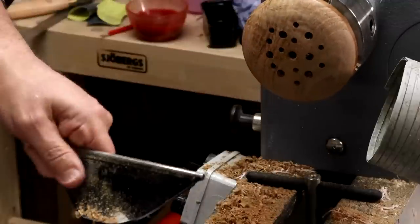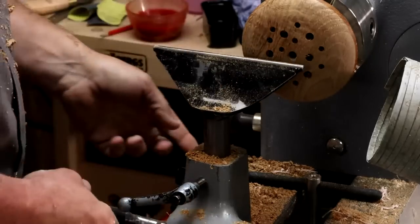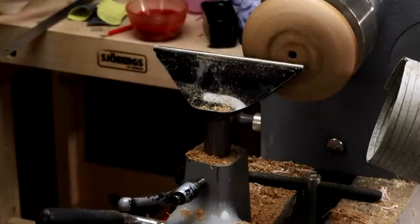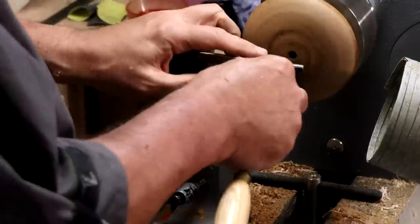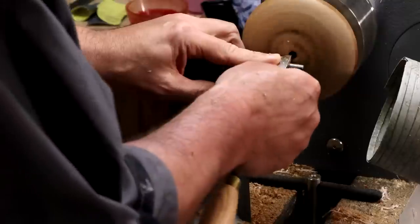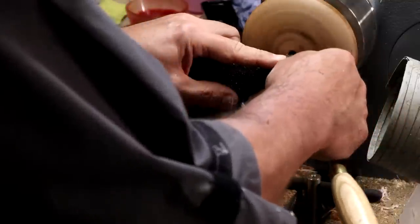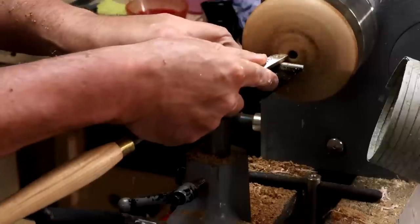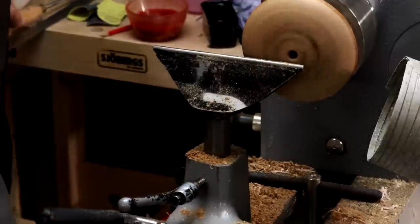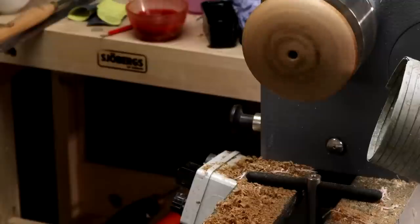Right then, let's start shaping — get rid of some of the waste first. Just a little draw cut — let's stop and have a check. Yeah, we're good. I'm quite happy with the shape, so I'm not going to do too much more — just a finishing cut and then we can sand that area. Just a little dome really. Let me stop and check what the finish is like — do I need to do anything else before sanding? I think we're okay. I'll just soften that very middle hole — that was the screw chuck — I can still see a little bit of thread there.